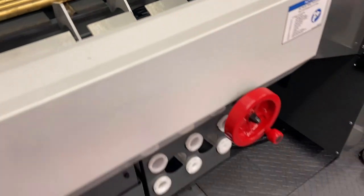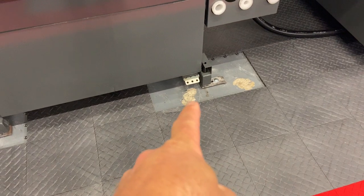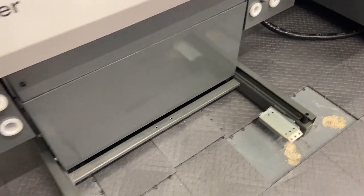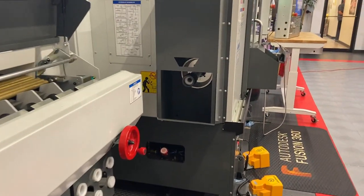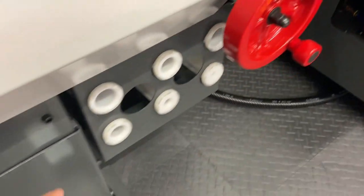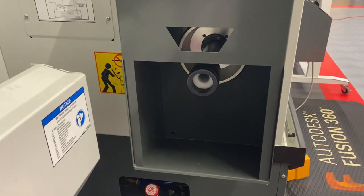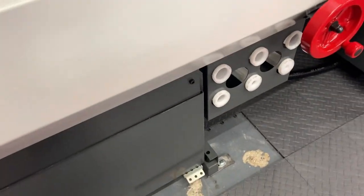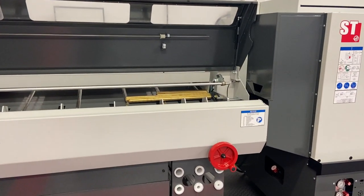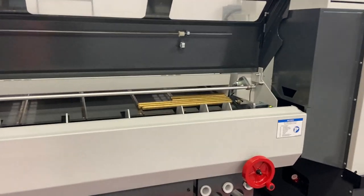The next feature I really like about the bar feeder is the foot switch down below so that you can actually slide the entire bar feeder out of your way. With the bar feeder in the rear position, it opens you up to your spindle so that you can unscrew your cap and change to your different size spindle liners as needed. When you're finished, all you have to do is pull the entire bar feeder right back into place — it snaps into place, the control senses it's in the right location, and then it continues to let you use your bar feeder.